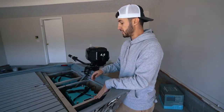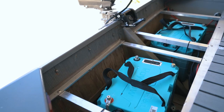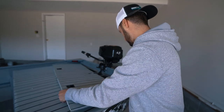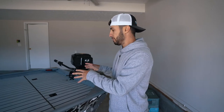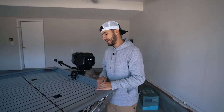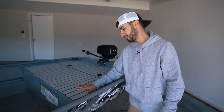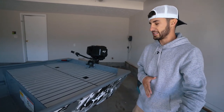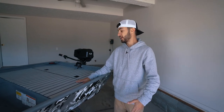In the back you'll see I have a box-out frame with the aluminum — fastened into the transom on one side and the bench seat on the other, so it's a complete floating boxed-out frame. I just take my one piece of PVC in the rear, slide it onto the track that I essentially made, and we have a solid deck. I left the back as one big compartment simply because it has batteries back there. The trap door makes more sense and it's more functional. With EVA foam on top, it looks like it's fully decked out, but this is actually just the bench seat — I made sure everything was flush and level so it could disguise as a deck, and that right there saved me a hundred dollars.